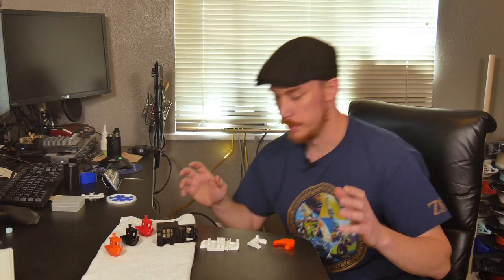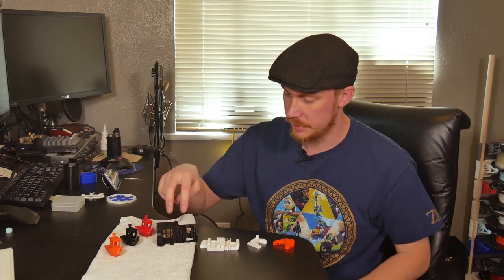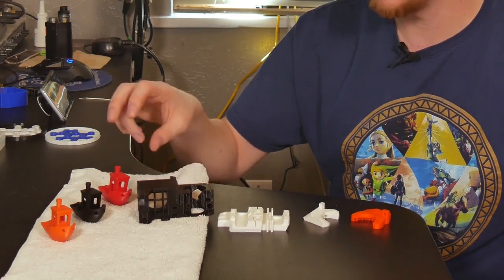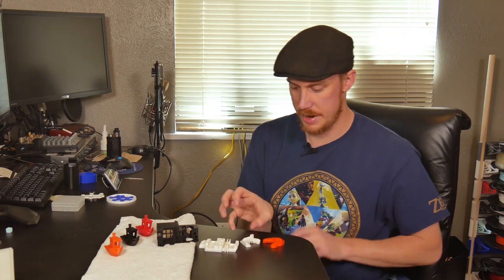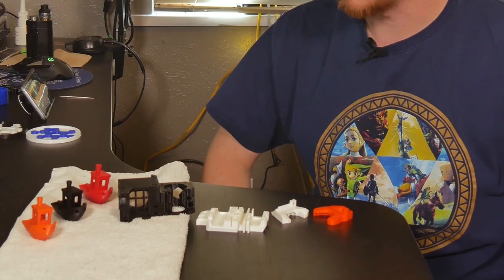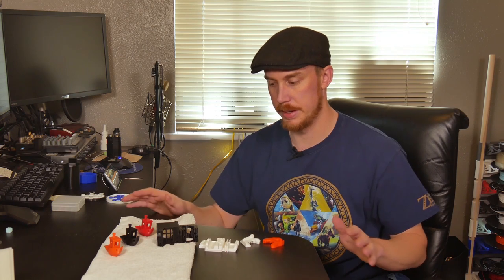So I use a Prusa i3 Mark III for my physical model prototyping, and they recently published a huge summer update on their blog. Of course I read it right away, and was hugely excited to see that they had upgrades to both the extruder body, for improved cooling around the heatsink, as well as an improved part cooling fan shroud, which holds the fan now at an angle instead of straight up and down, which allows a little bit more air to flow around the part. Now, I was so excited to see that I went about printing all the bits out right away.